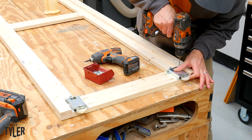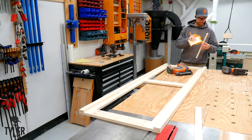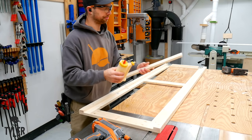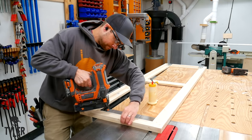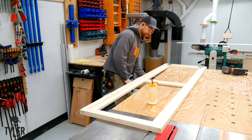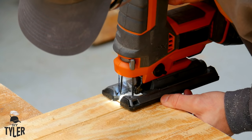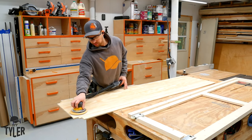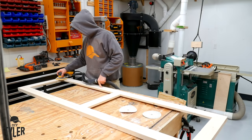As established, I am reusing hardware from the hideous glass doors, but you can find hardware like this at the box store or on Amazon, and there are much more beautiful options if you want something pricier. We're adding those top and bottom strips, and the bottom one is actually just cut in between the rollers - the easiest method. A little bit of measurement later and I had this crazy cut to get around those rollers at the bottom so we could glue our T111 panel in place.